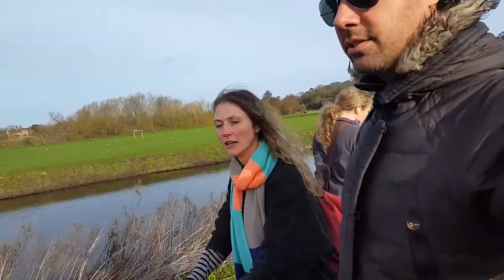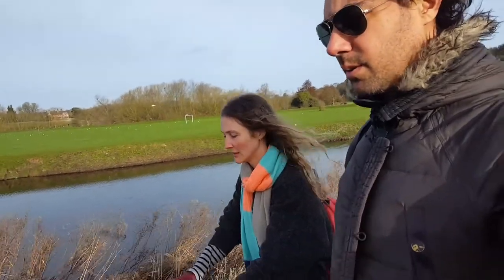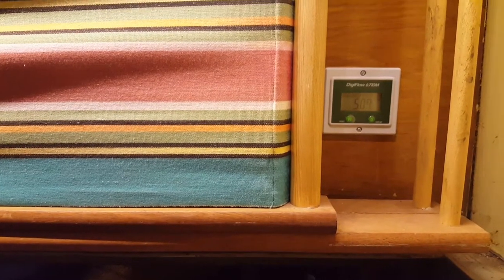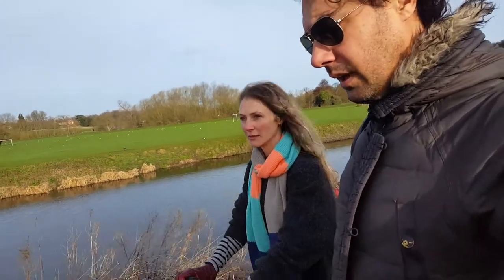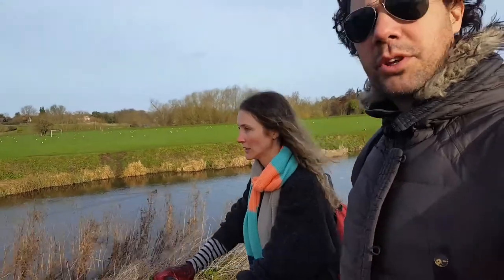It's good having a new pump, but we really need the UV filter to work as well so that we don't have to rely on the ceramic. We can get some decent flow rates — we're getting around 5 litres a minute at best with the new pump. We were hoping for something like 22 litres a minute. The UV filter is rated at 22 litres a minute and this new pump should be able to do that if it doesn't have to push through the ceramic.